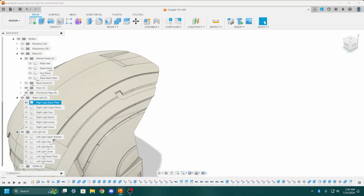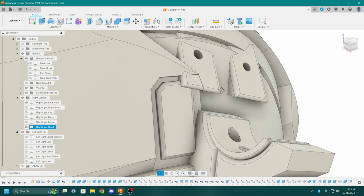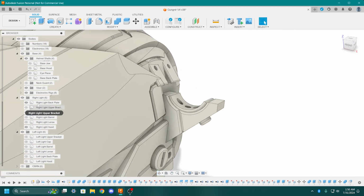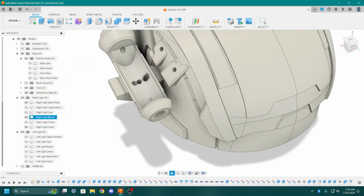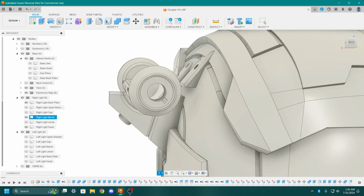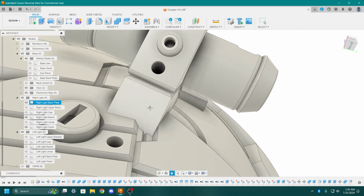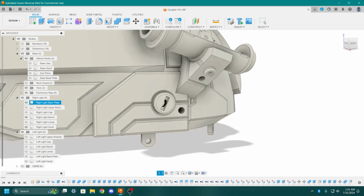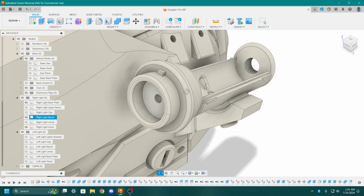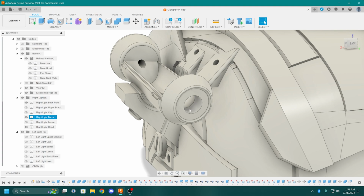Following with the light, we have the light backplate and the light hood. You can see where those two marry up. That's what I was talking about. And now we're going to get to the barrel. So this is the light barrel. This slots in here. It's going to be screwed into place right here. This channel on this side is your wiring channel to come down. There's going to be a cross wire here that is going to get jacketed from here to here for your wiring. And then there's a little LED here, as well as an LED on the tip here for the actual light. And this port in the back is for the push button switch. This is going to be an on-off toggle switch.